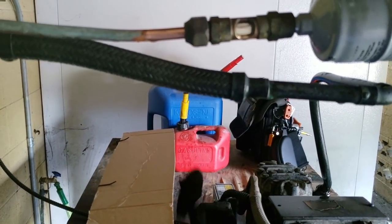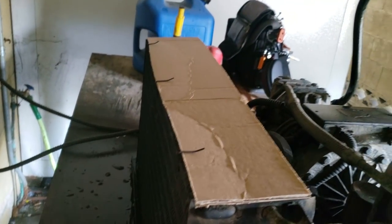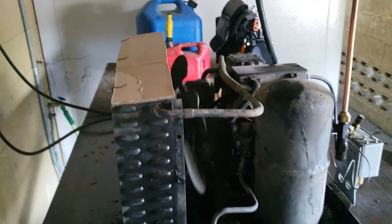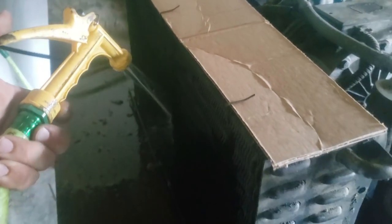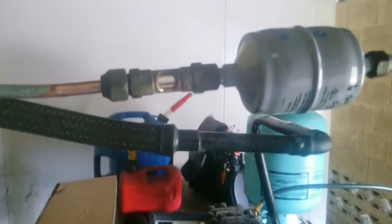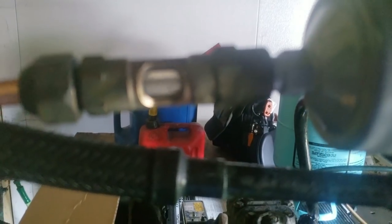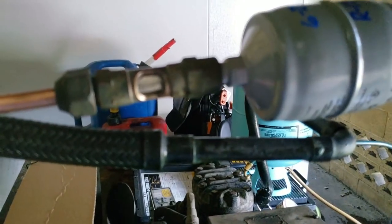But now we're showing a little bit low, so that's kind of scary. We may need to add a little more to it. We're going to let this finish drying off, but if that's showing low when that coil is wet, it means we've got to add a little bit more for the winter charge — it's going to be low this winter. So I got the other gauges back out. We're going to cool this thing down a little bit and see if that flashes off. You can see the movement in there — we're not getting crazy, just bringing that temperature down.